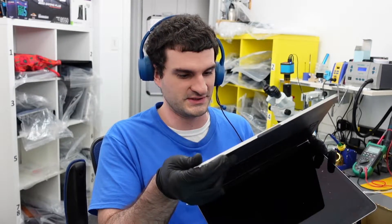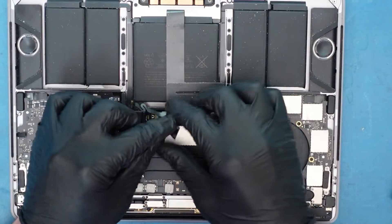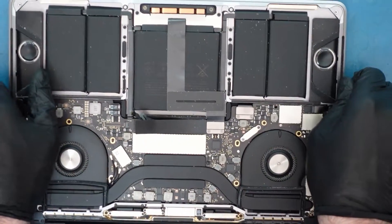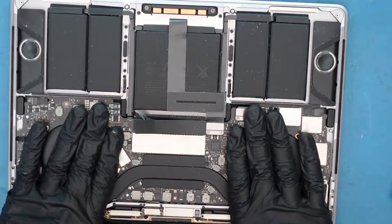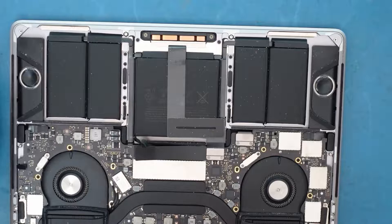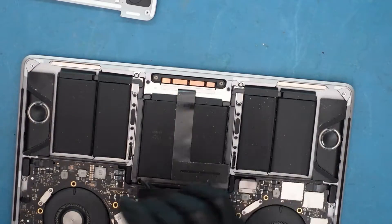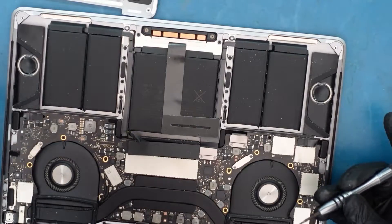It actually did turn on, and I did smell some burning, so I had to stop it for a second. I don't see where it's coming from — it's probably underneath the board. We're definitely going to need to open up the board. I disconnected the battery connection here just to make sure there's no problems with that, and I'm going to open it up because I want to see really where that's causing damage. You could really smell it. I don't think it's the battery — I do think it's somewhere on the board. I don't feel any place getting warm, I don't see any obvious damage, and I don't see any type of liquid spill. I should probably put on my mask too.